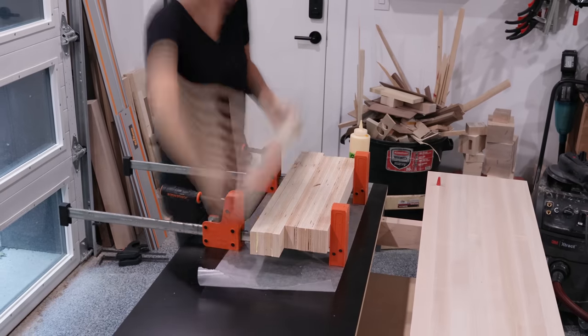After using the spacers for placement I moved them out of the way so glue wouldn't stick to them yet. I moved the whole assembly to the flat hardwood worktop and used cauls to place pressure in the middle and press them down towards the flat worktop. You can also brad nail these into place if you don't have enough clamps. I'm going to attach the tops to the base using lag screws, and since I don't think half-inch MDF is strong enough to hold that I glued maple blocks in the locations where the screws will go, which I already knew because I drilled recess holes in the apron of the base in part one.